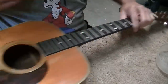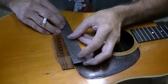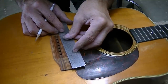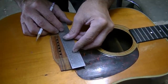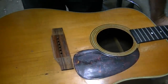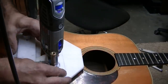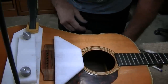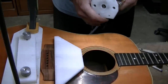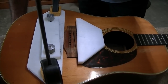Now we'll get back to the business of cutting the slot. First thing I'm going to do is extend the line all the way across there, holding it really still so it doesn't move. Then I'll draw the back line in there too — it sometimes helps to be able to see both lines when lining up the cutter. That looks good — got a good parallel line there. Now we'll get the cutter out and see what we can do about cutting the slot. We've made our first pass. I think I'm going to go a little bit deeper — it looks a little shallow, so I'll go at least another 50 thousandths deep. That should be done. We're going to make a saddle now to fit that slot.